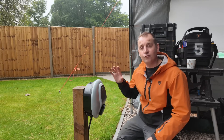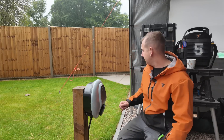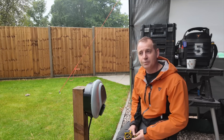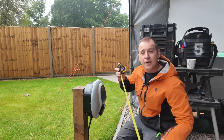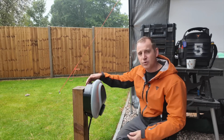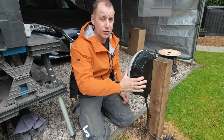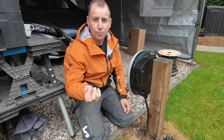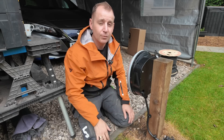I'm going to point out several things that are wrong with this installation, starting with the height. The socket point on an EV charger should be a minimum 750mm off the floor — this one is 400mm. It's also only got half its fixings onto this post and it is not secure. This has been taken out of an old property and relocated into a new property.